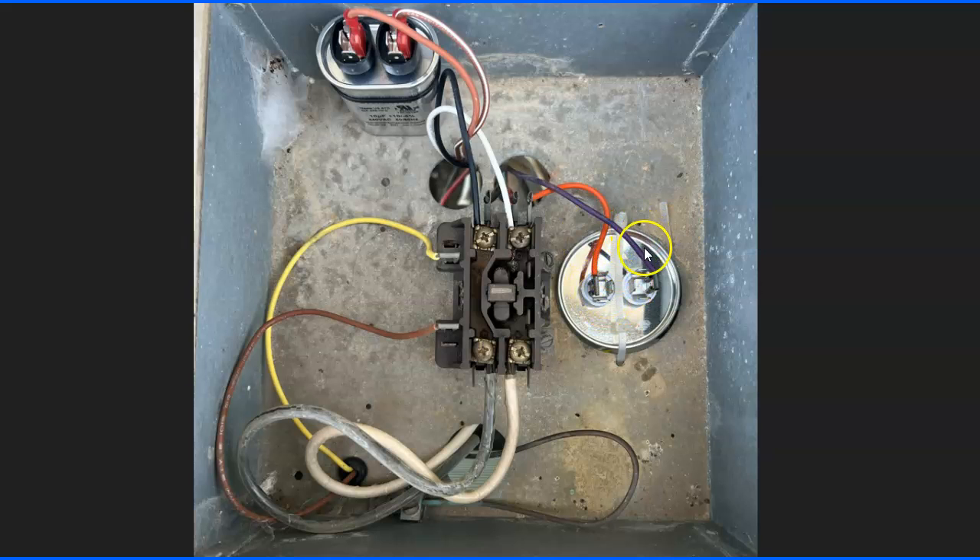The problem is the new capacitor would not fit in this hole — it fell right through. So I ran some zip ties underneath it and all the way around, and put it through the screw holes that were holding the other capacitor. That's how I'm holding my capacitor vertical. So this is the new capacitor — it's just a straight 60. This is a straight 10. My old engine took a 3; this is a 10 for the new engine. My old capacitor had 60/3 because it ran the motor and this. Now my motor is on its own capacitor which is a 10, and my compressor is on its own capacitor which is a 60.